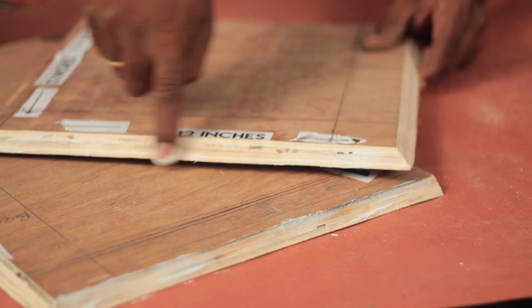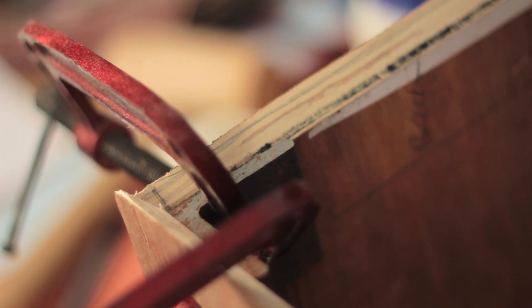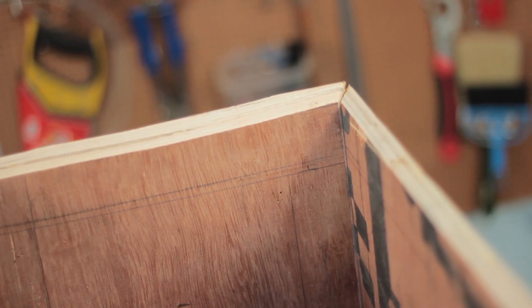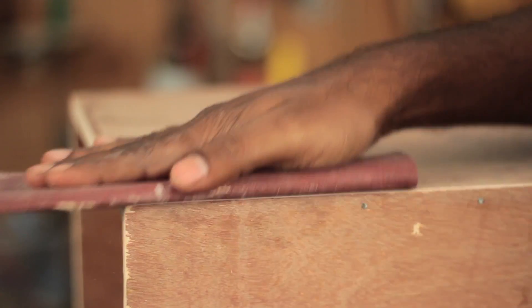Now the pieces are ready to be glued, making sure they are squared. Makeshift corner clamps were made with a piece of angled iron and C-clamps to hold the pieces together at a 90 degree angle. After making the fine adjustments, the setup was left to dry. I ran into trouble with the miter cuts I made with the jigsaw — it's not advisable if you do not have a proper blade guiding system. Simply go with straight cuts and put the box together. I didn't want to abandon the project at this stage so I went through the complete cycle.